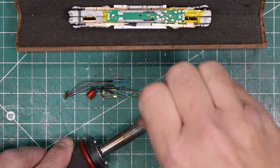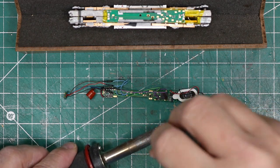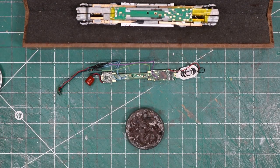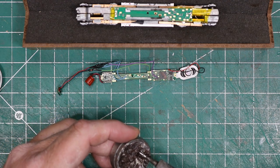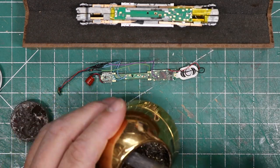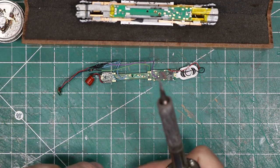In preparation for installing the ditch light wires, I had to replace the larger tip on my soldering iron that I used for track and feeders with a small sharp pencil-type tip which I use for fine electronics. Obviously do this before turning your soldering iron on. I have a variable temperature soldering iron and I lowered the heat to medium for this job. I have my soldering iron and everything that I use for soldering in a project like this on a product list on my Amazon store — I'll include a link in my Amazon Pick of the Week in the description below this video.